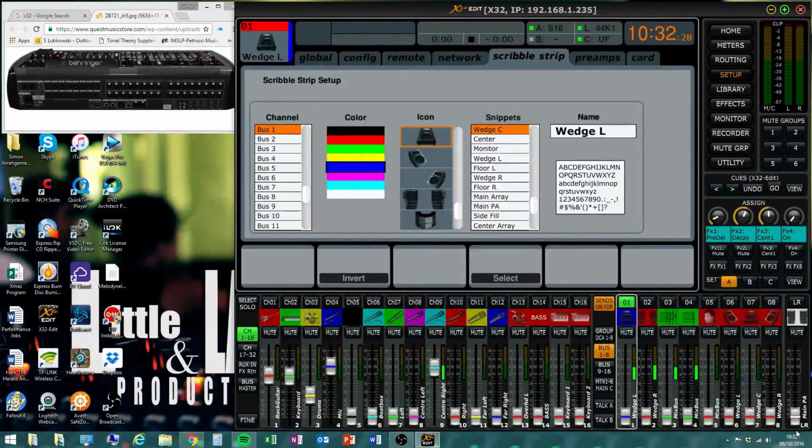Now, if you don't have the ability to talk to them through the mixing desk and through a monitor backstage, you actually have to physically leave the mixing desk, run down there, and try and sort the problem out yourself. But that is not ideal, because then you end up running potentially backstage. Nobody's manning the mixing desk. If anything starts feeding back, nobody's there to turn it down, and everything gets very complicated and not very professional if you start doing that. So it's very useful to have a monitor backstage to be able to chat to people backstage.